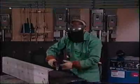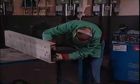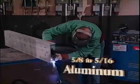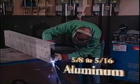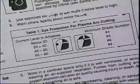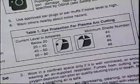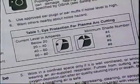Safety equipment and clothing requirements for air plasma are about the same as they are for welding. Full-face helmets or face shields are acceptable for eye protection. Filter shade density can be selected on the basis of power source amperage. Consult the owner's manual for recommendations.